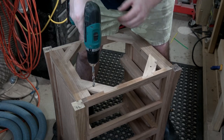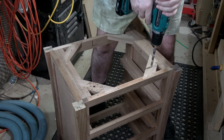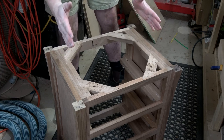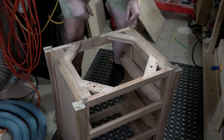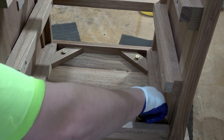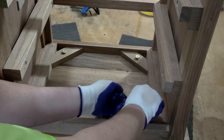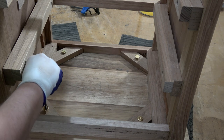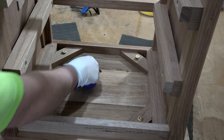I've got a 9.5mm drill and I can just open up the hole. Since the back ones won't move, that holds the top from shifting sideways. It'll just expand and contract backwards and forwards. This creates a really nice solid fixing that can be undone whenever you want — so if you need to refinish the top in 100 years, the guy that has to do it will just say, 'Too easy, mate.'